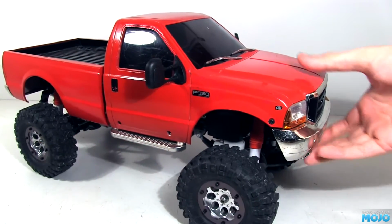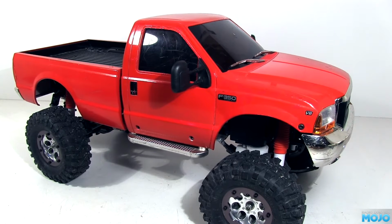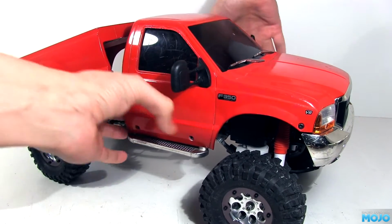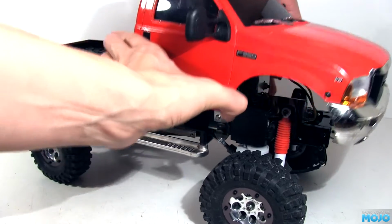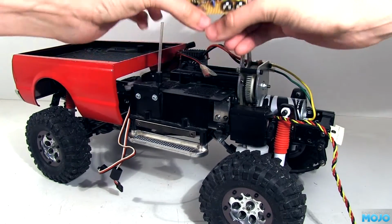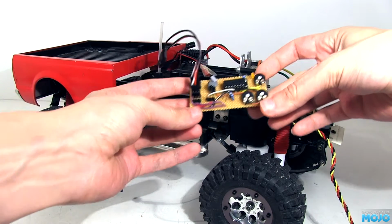Often a tripping point if you don't want to mess around with an aircraft radio and want to use a pistol grip. To get around the limitations of my other radios, I made up some electronics that let me shift gears using the usual 2-position third channel, but it was a bit of a pain to use. And of course with that installed, there's no way to have control of a lighting system. I needed more channels. That takes us nicely onto the receivers.